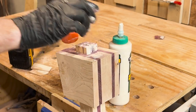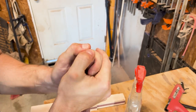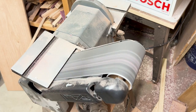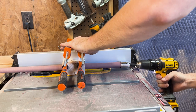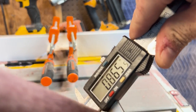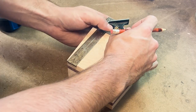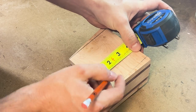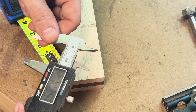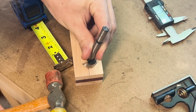I felt my mallet was still quite blocky, so in usual fashion I wanted to add some dowels to spice it up a little bit — I've used dowels in my past builds including the sushi board and serving tray. I took my earlier piece of purple heart and sliced off a 7/8-inch piece. These were quite large compared to other dowels I had done, so I needed to use a table saw mounted jig to make a dowel rod perfectly 7/8 of an inch. I traced out the center points on the mallet to drill for my dowels, spaced them an inch from the sides, and due to the gentle slope from top to bottom, the holes would be offset to complement the angled cut. This would also help secure the handle even more because it did go through it. I also decided to put one through the pommel of the handle as well to complement the head.